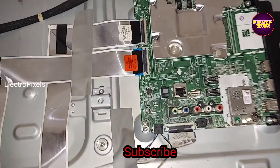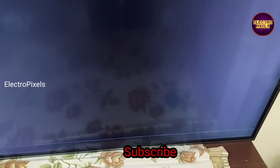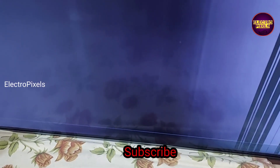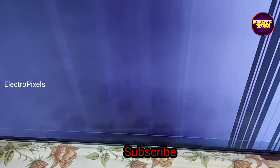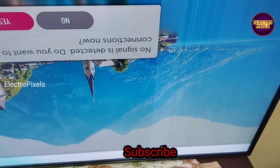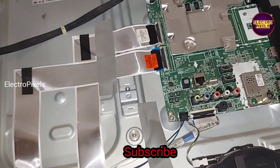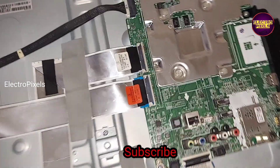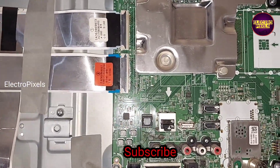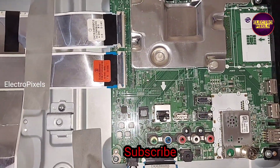So that's why this complaint occurs. After reconnecting these two FFC cables, here you can see the picture comes back with vertical lines along with the picture freezing issue. So this panel is not repairable and we cannot use the taping method. If one side of the panel were okay, we could use the taping method, but here both sides are shorted, so panel replacement is the only solution. Hope you liked this — thank you for watching. See you in another video with another interesting topic. Please don't forget to like, share, and subscribe.